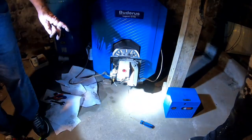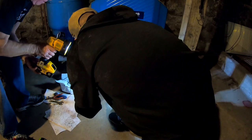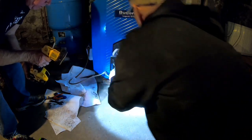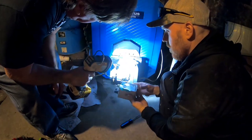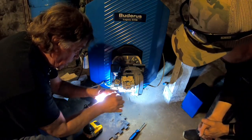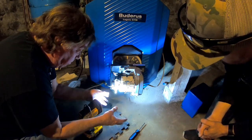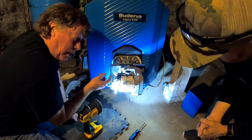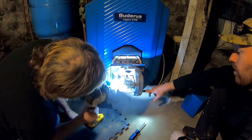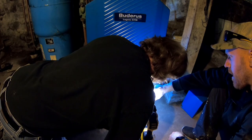I've got to shut the power off. Let me take those two screws out. So these are your electrodes — the electrodes go down like this, and the nozzle is at the end. When the oil comes out it atomizes, sprays, and fires. There's a cad cell eye in there — it says 'I've got a flame, I'll keep running,' but if it doesn't see a flame it trips out. When we started it before it seemed like it ran longer, so maybe we want to bring this air up to one.